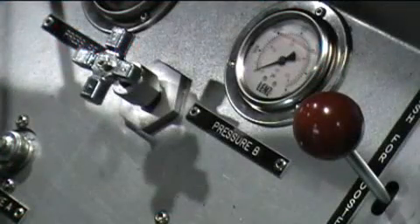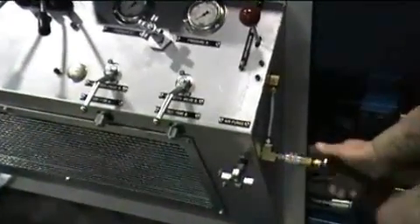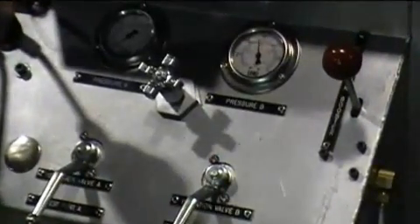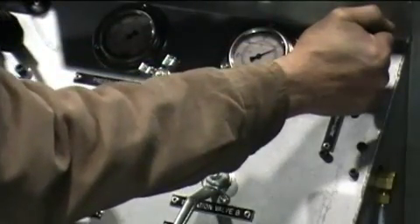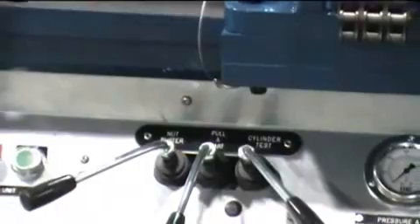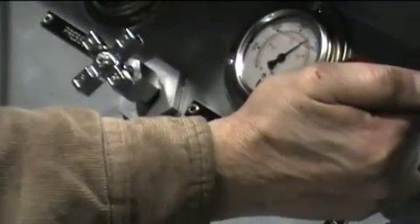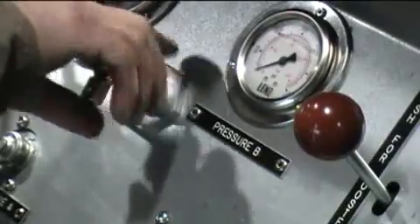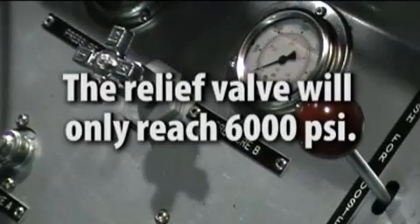There is an air valve mounted to the control panel with a red ball on the handle. To operate the pressure booster, attach an airline to the quick-disconnect coupler. Use the cylinder test spool to pressurize the test cylinder to 3,000 PSI, then push the red ball forward to activate the air pump. It will only take a few pumps of the booster to take the static pressure to 5,000 PSI. Use the cylinder test spool to release the pressure on the A port, then shift the spool to the B port and push the red ball to boost pressure to 5,000 PSI. Use the test pressure bleed-down to relieve any pressure trapped in the test lines and PO checks. The relief valve will only reach 6,000 PSI.